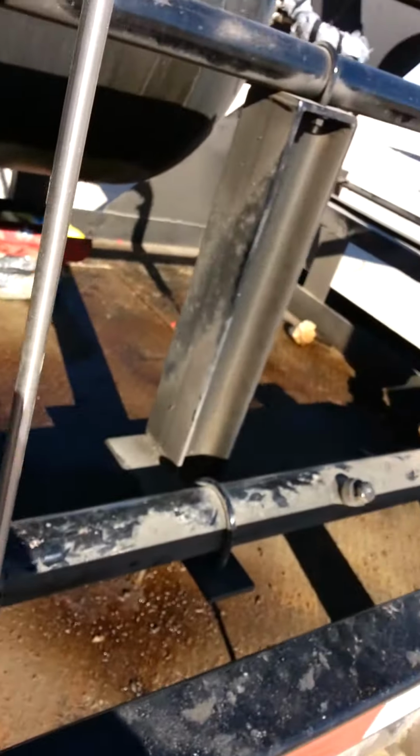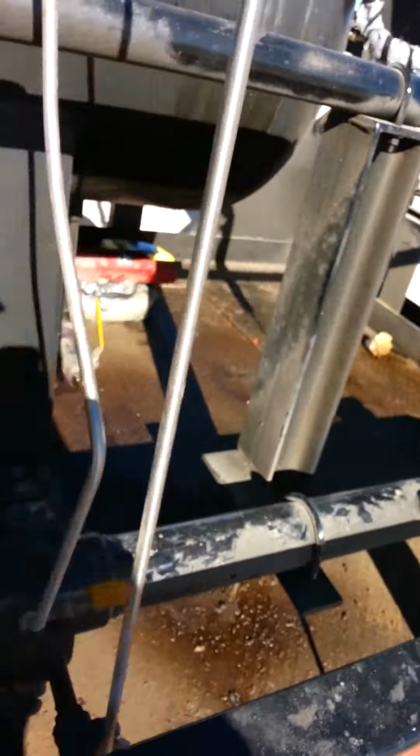Normally you want to check it on your line though, right before your Daniels. Anyways, back to the Barton meter. As you see, the differential's jumping up and down as it dumps water and oil. So what you're going to want to do is read in between the strokes.